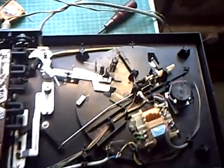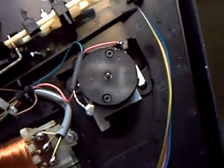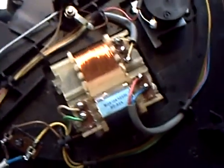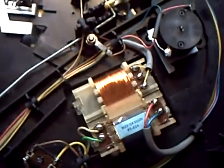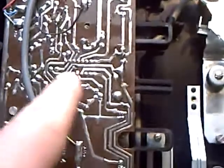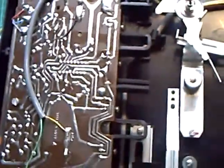And this is a curious mixture of ancient and modern, this set, because this was found in the very early ones. Little battery mains jobs, this little motor here. The mains transformer looks the same as they used to as well. A lot of the mechanicals look very familiar. But unfortunately, despite the microchip preamp, they still use the old germanium transistors in this.